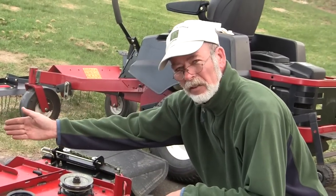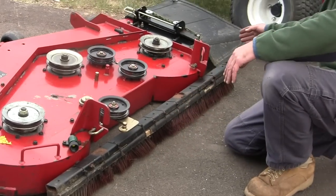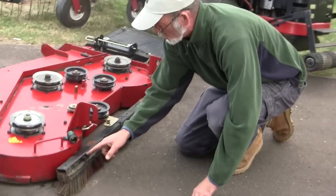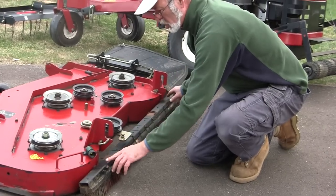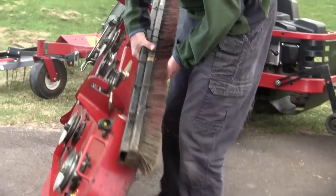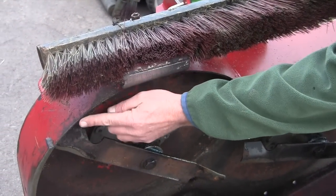This is what I've taken those same principles and applied to this mower here. There are two 24-inch brooms and a 6-inch broom — it goes blade tip to blade tip, so it's completely covered. This is a chunk of steel. I drilled a hole through there, put the bolts under the deck. A couple of washers on it just to space it out. It interferes with nothing. The broom bristles are about a half inch below the steel of the deck.